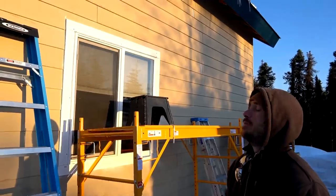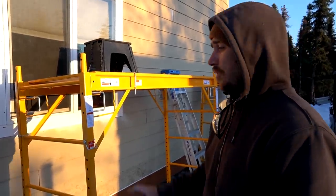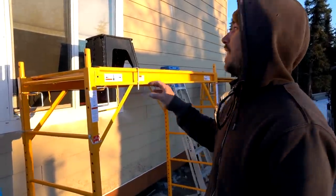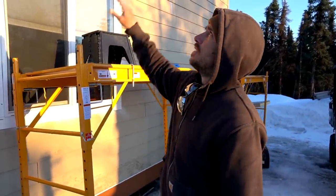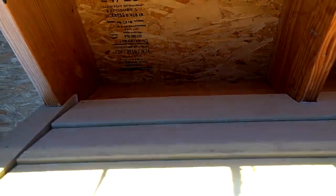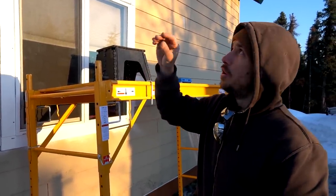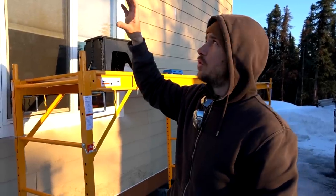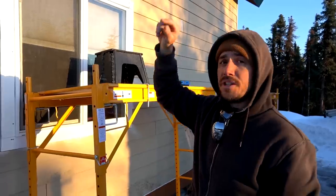I think my back's broken, but we did pretty good today. We got the wall done — it's pretty late in the evening, almost 8 p.m., but it doesn't get dark until almost 10 o'clock. Stuff's starting to freeze and temperature is really dropping. We've got ice on the scaffolding, so we're going to put it out in the sun and hopefully it'll thaw out tomorrow. On this side we learned from the last: once you start getting close to the top, you want to start taking measurements on your reveal. Otherwise you might end up with a really small last board. We went from about a seven inch reveal, knocked it down to six inch, then five and a half all the way to the top — worked out perfect.